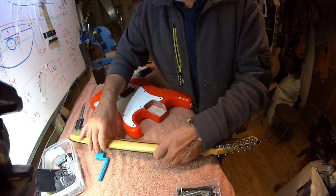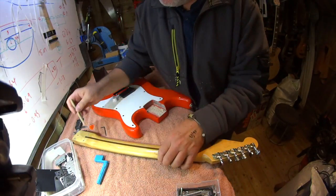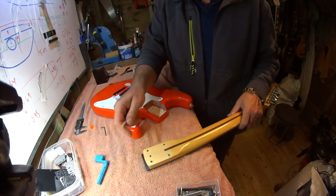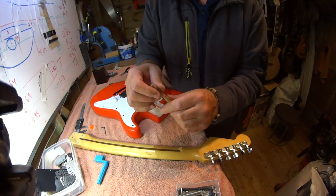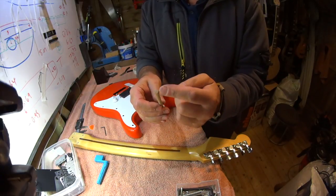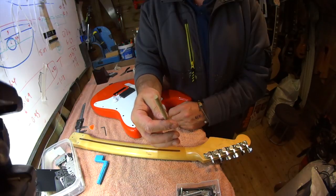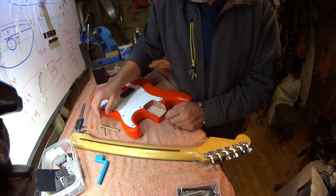And I just noticed earlier on, I happen to have some oak dowel, which I found a cute way of making, which is much harder, obviously, than the maple, and certainly harder than the relatively soft wood inserts in here. Having struggled for ages to make dowels from solid timber, I haven't got a supply of oak dowels. But what I found was on the tongue and groove pieces that I can get, the tongue part, chiseled off or hacksawed off, makes, as it happens, very easy to make a nice dowel from it. So I've got enough to do those four, and I would think this deserves it.